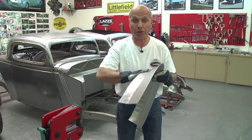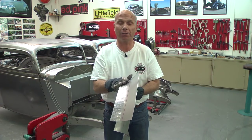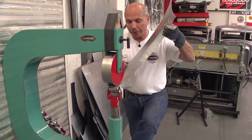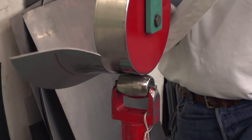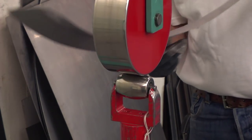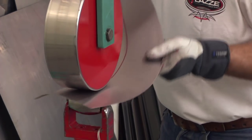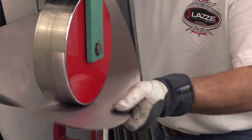I think I should go to the third wheel now without the rubber band and smooth it out, and then roll it. Those small dents here — I can't get those out with the rubber band on, so I need to do it with two solid wheels. So back to the wheel with low pressure, just roll it so I can smooth this out. It can be a little tricky to roll it in a curve, but practice makes you better and better.